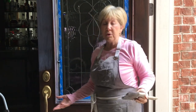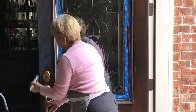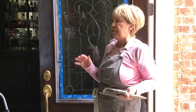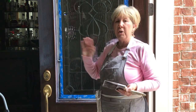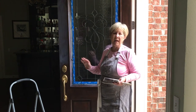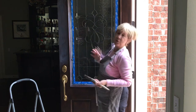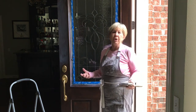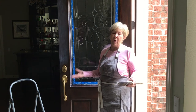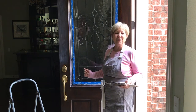You can use one coat or two coats. For now I'm just going to use one, and you want to give it about an hour to dry. Then, if you want to give a second coat of sealer, you want to use a light 220-grit sandpaper to sand it down, wipe it down, and then add a second coat. After you've added that second coat, you want to let it sit for 24 hours. If this were a piece of furniture, you would want it to sit at least 24 hours before you set anything on it — maybe even longer. So I'm going to finish doing our matte sealer, and then I'll be back to show you the finished project.